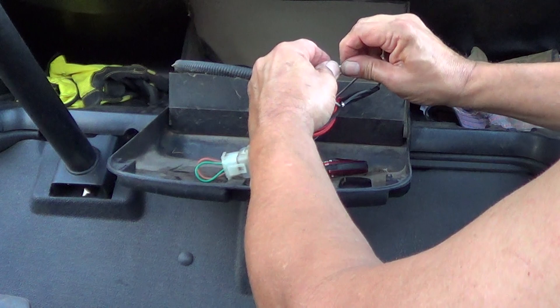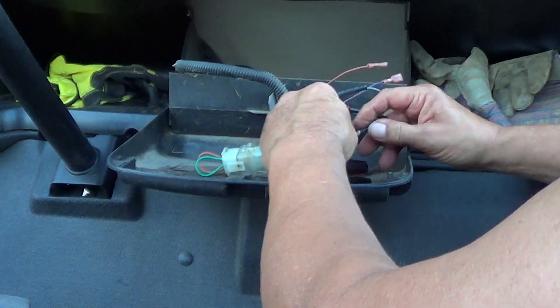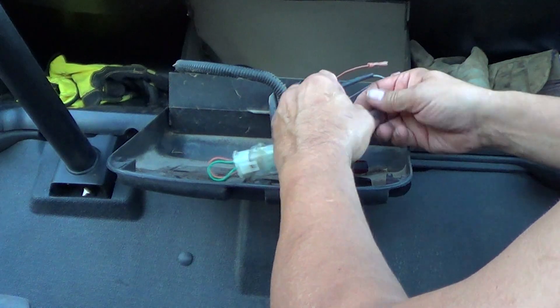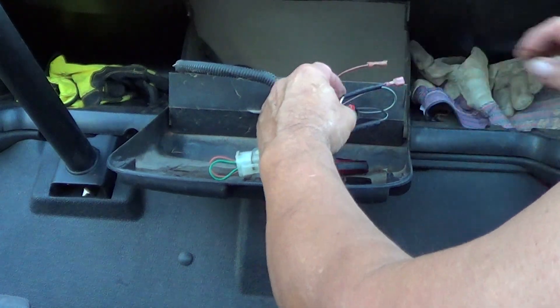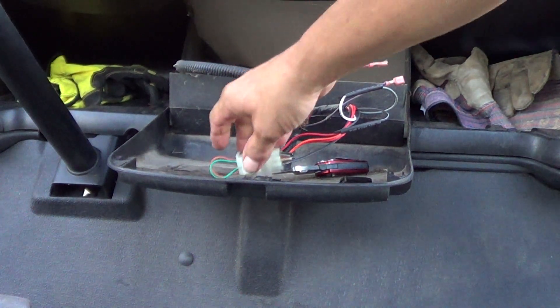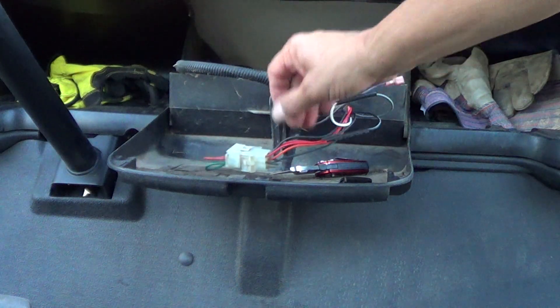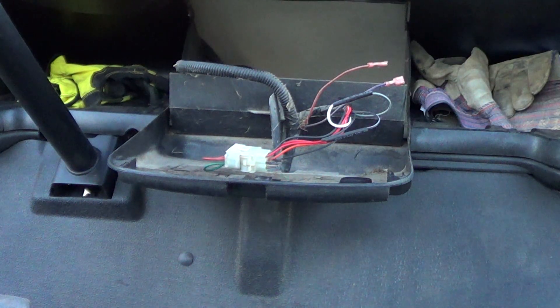My habit is to work with little bitty short pieces of wire when I'm connecting them together like that, because a lot of times I don't have a lot to work with and I've learned to work with very little wire. It's cooled off enough that I can touch it now. Bring the heat shrink tubing out here — see if I can get it over that big old knot I made there. Got it just about centered over that knot. Put a little heat to that, shrink those down, make it a nice weather-tight connection. And that plug can cause me no further headaches now. I will just be leaving it up inside the cup holder like so, because I don't have any need to have it sticking down below like it was before. Alright, thanks for watching.